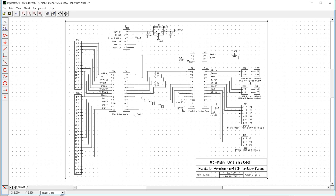And then here, instead of actually putting a solid state relay in here, I'm going to put pins inside the sockets where the relay would normally plug in and just take off. These are 5 volt signals, so pin 3 plus is always tied to plus 5 volts, and then pin 4 is open collector, so it will pull to ground or float. So I put a 1K resistor in here so that I can detect when it's pulling up and down. And then these are just going to be wired into digital inputs on this guy over here.